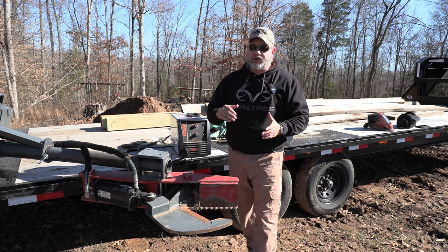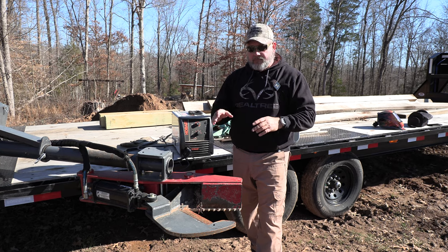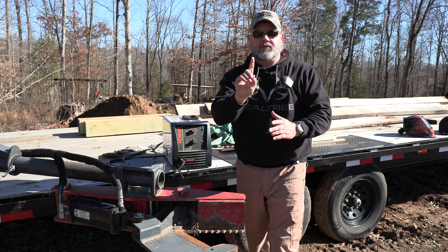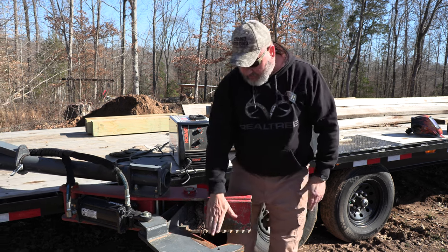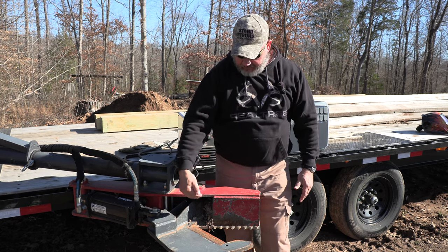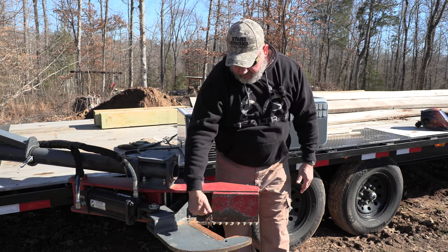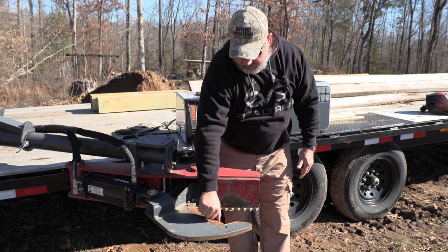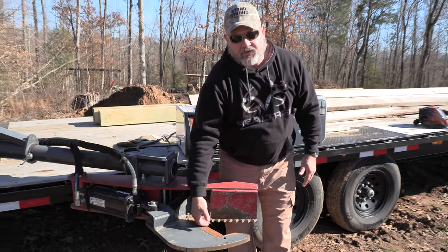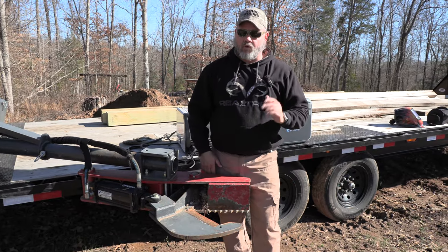However, I found out the hard way that you cannot snip off a 7-inch tree at the ground if there's a steel spike through the center of it. And we really put some damage to our blade. So today I'm going to take the welder and clean this up and weld a new edge on this, and come back with the grinder and grind it off back to a precision cut, hopefully.